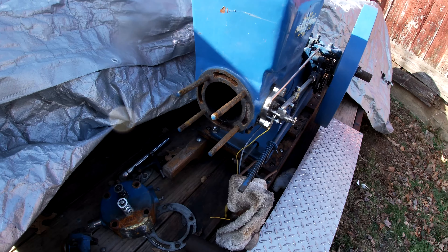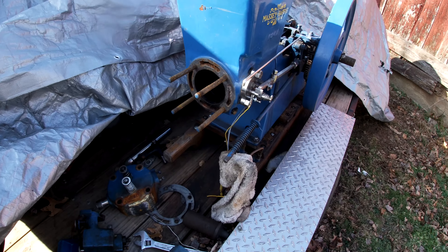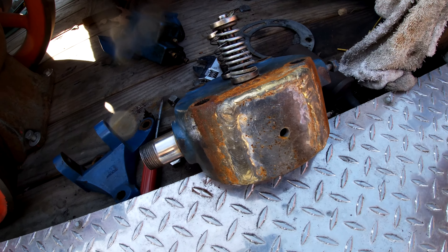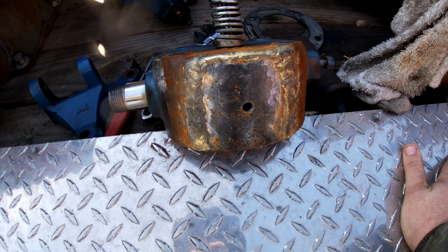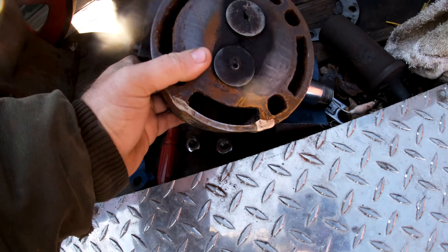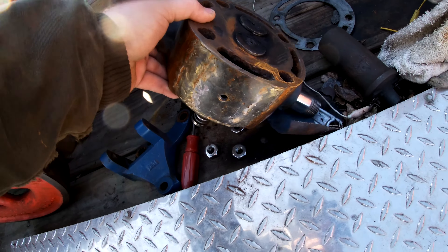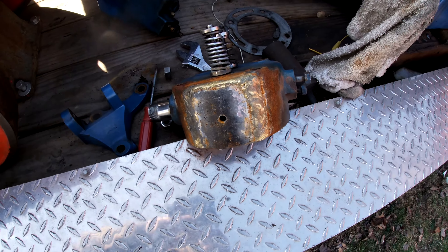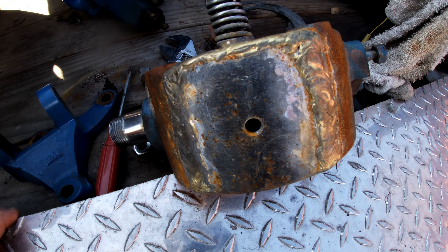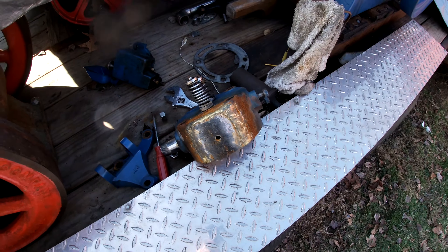This is on my show trailer and I've been meaning to get this done to put it back in the shed. At the fair it started leaking water really badly — it had frozen and burst over the winter since I hadn't used it for two years during the 2020 shutdown. I had drained the water out, but the casting held just enough water to burst it. We had it brazed up and drilled and tapped for eighth-inch pipe thread so we can put a drain right in the head to make sure this doesn't happen again.